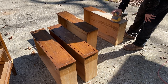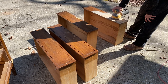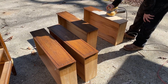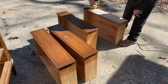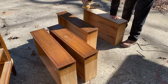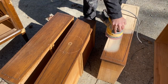I realized that the wood grain underneath this finish was actually really nice, so I decided to bring it down to bare wood so I could keep it natural and only paint parts of it. As you can see, I'm going very, very slow here and putting minimal pressure — this will minimize the amount of little squiggly marks left on your wood. The more you press down on the sander and the faster you go, the more of those marks you'll end up getting. This method is used when you are going to either stain, bleach, or just want the natural wood finish.